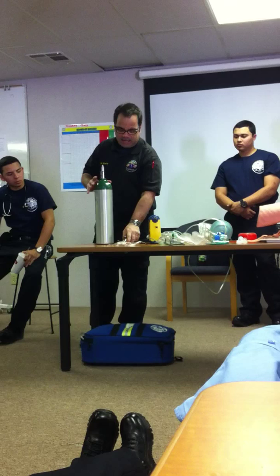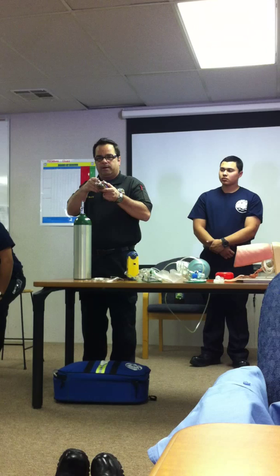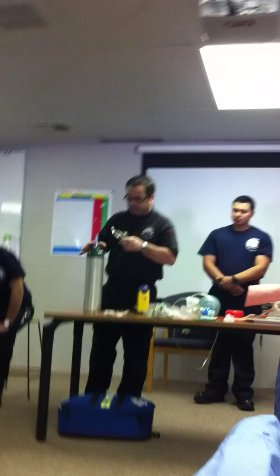So it's ready to be used. I'm going to go ahead and take my regulator and put it on the bottle. You see the bottle — it's got one big hole and two small holes. If you look at the regulator, it's got one big prong in the middle and two small prongs at the bottom. You just match those up with the holes and put it in place. Let's hand tighten it on.